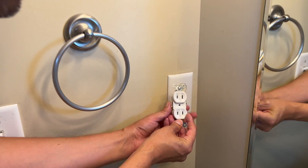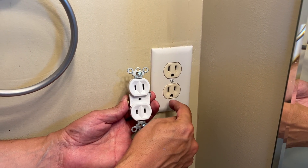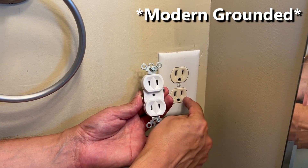This is what the original outlets may have looked like. Is it a safety hazard? It is deceiving because when somebody looks at it, they're going to assume it's a modern grounded outlet when there's no ground back there.